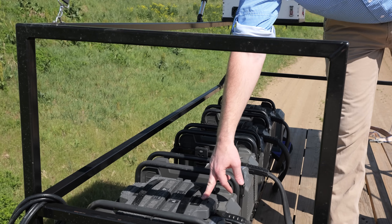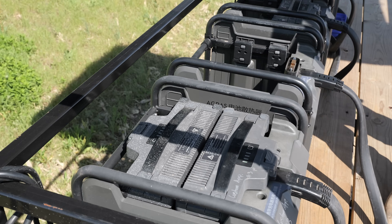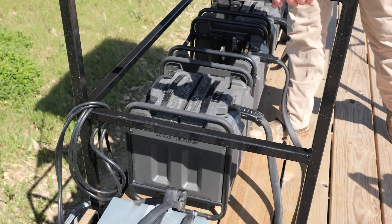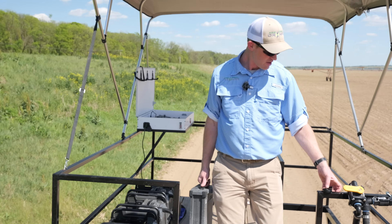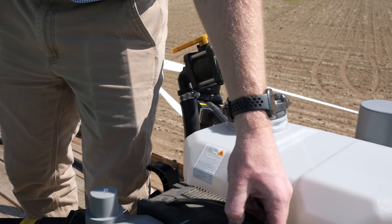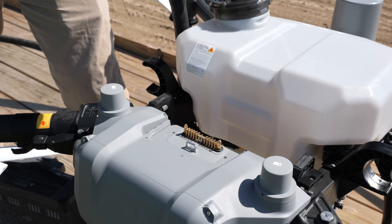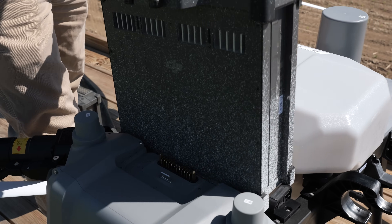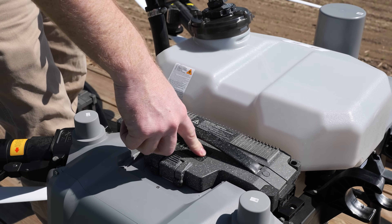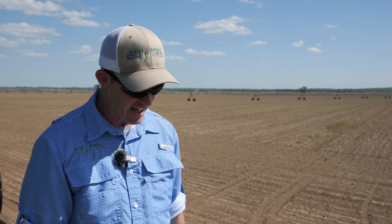This battery already has four bars — I started charging it late, so we have about a minute lag. We're going to rotate in our third battery in this set. We came back with over 60% battery this time. On big fields, because this drone flies fast and empties the tanks fast, you can actually get two flights per battery charge. But why do that when you can just change the battery in the same time it takes to fill the tank? Increase redundancy and swap that battery every time — you never know when something happens.